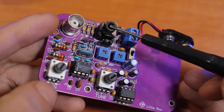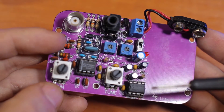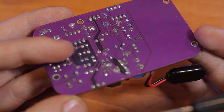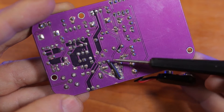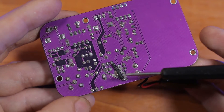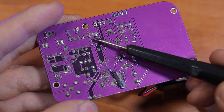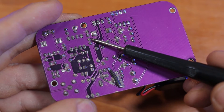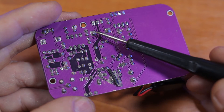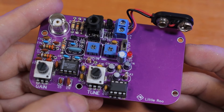I'm going to talk about the audio output when we do the demo. I messed up a couple of capacitors when I took the kit apart, but I replaced them with some of my own. I also damaged a trace on the back and had to relink two points with a piece of wire, insulated to make sure I wasn't shorting anything. The original kit was soldered with lead-free solder, and when you heat that up you really have to crank up the soldering iron to remove parts — that's one of the reasons I don't use that solder. Anyway, let's jump to the demo and see how it sounds.